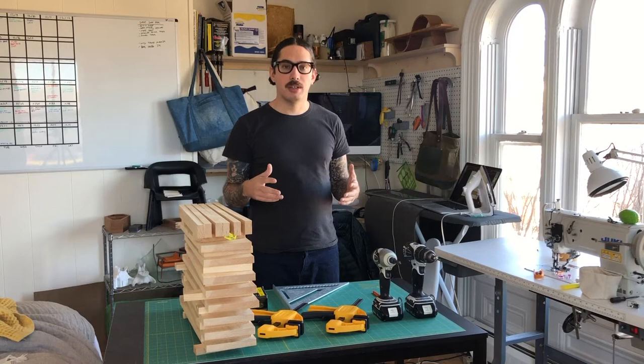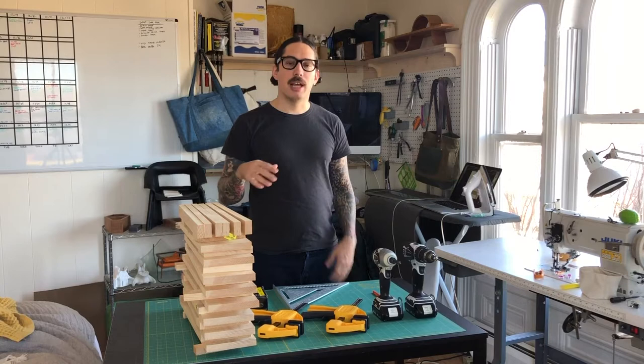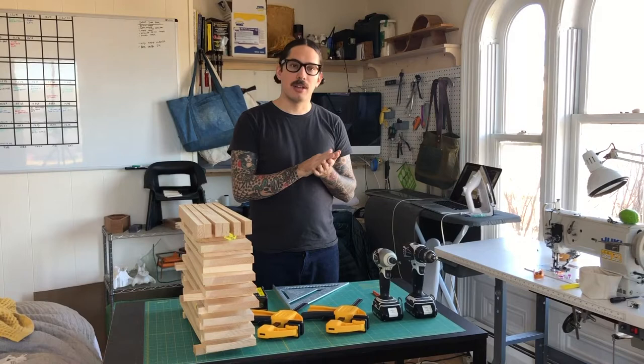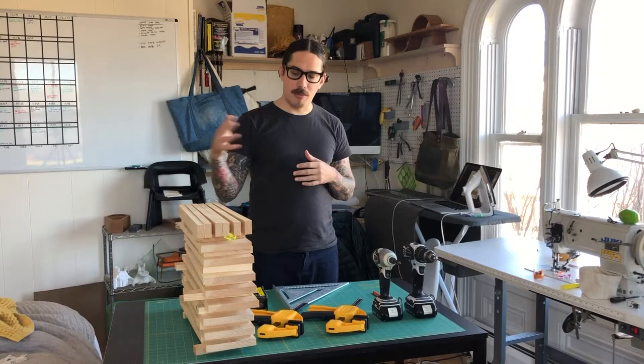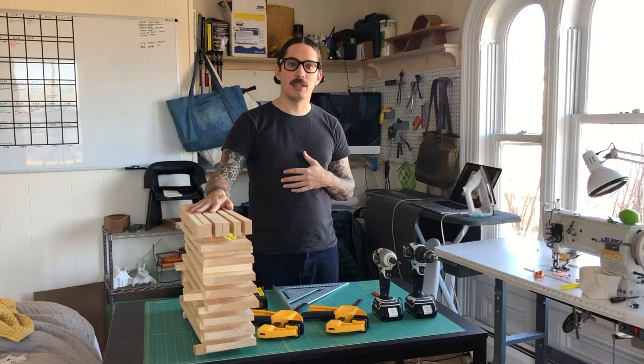Now that we've cut all our parts, we're going to start to assemble the chair. I cut my parts a while ago, and after I cut them, I stack them in this fashion and set them aside. Putting little spacer blocks between each board allows air to move all around the board. Wood expands and contracts as the moisture content changes, and if we cover one face or edge and not the other, the opposing side gets jealous and the board will warp. So by doing this process that we call stickering, allowing air movement all around the board, we'll keep our boards nice and straight and flat and ready to work on.